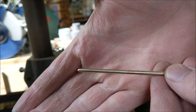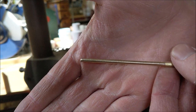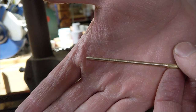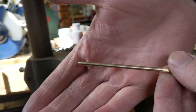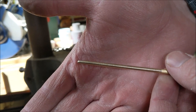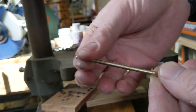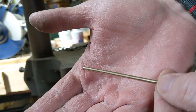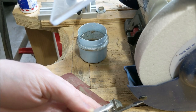It's just under three millimeters — I measured it with digital calipers. What worked best was a file braced on the other side with my hand, slowly moving it back and forth. That took off a consistent amount of metal. Then I moved through a couple of grits of sandpaper to smooth it, then used the edge of my leather strop for a little polish. It's very smooth to the feel. I just want it smooth enough that I don't have to worry about snags as I'm putting it in.